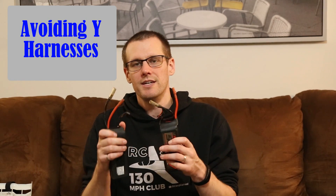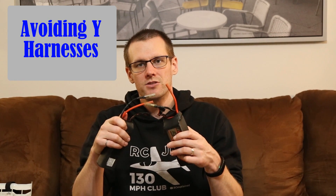Another advantage is that I'm able to take multiple batteries and put them in series very easily just by connecting the bullets into one another. Anytime you're using these individual bullet connectors on a battery pack, you will have an exposed male connector. The female connector goes on the red, positive battery side, and the male connector goes on the negative battery side. Whenever you're not using the battery pack, place a cap over top of the male section and everything will be very safe.